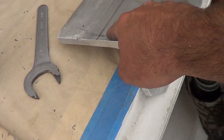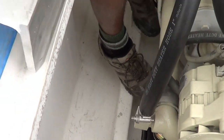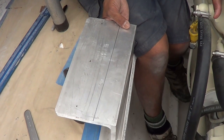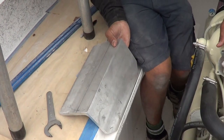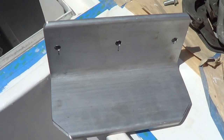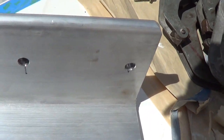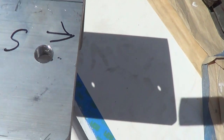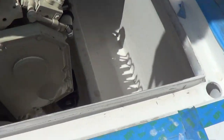We held it up there and marked the top of the stringer right here, then we're going to drill three holes in there - kind of at the halfway point between the stringer and the bottom of the bracket. Half inch bolts. We've got the stringer brackets drilled - one for port, one for starboard - marked this one forward starboard. Now we're going to get them down in there, clamped and mocked up in place, and then drill through the stringer for a through-bolt.